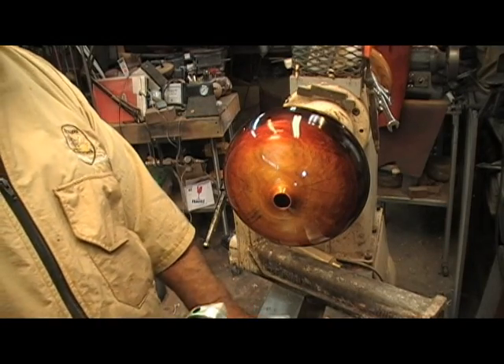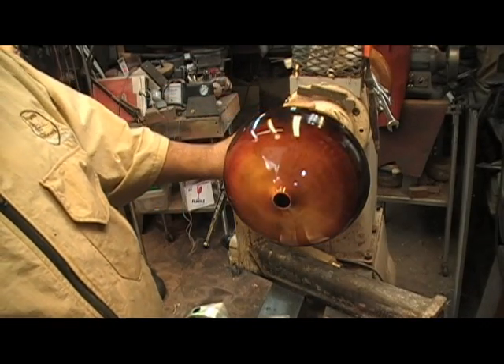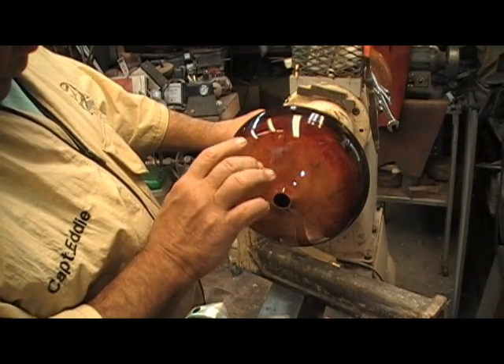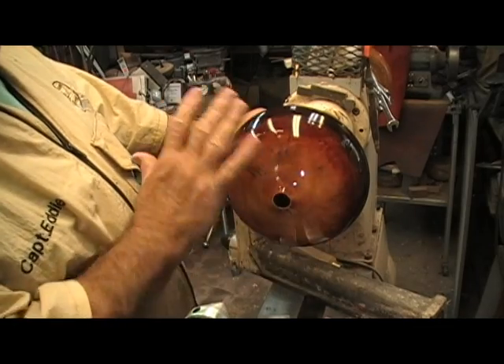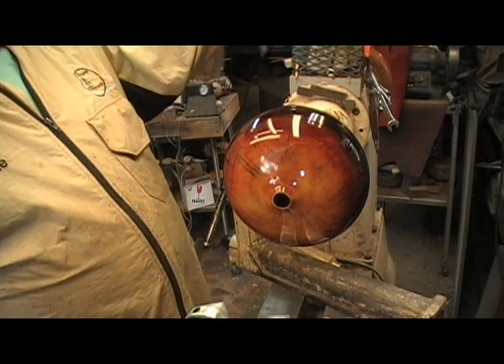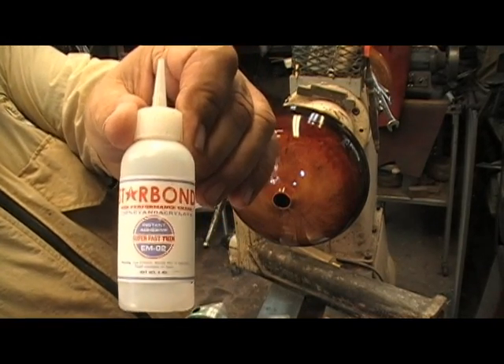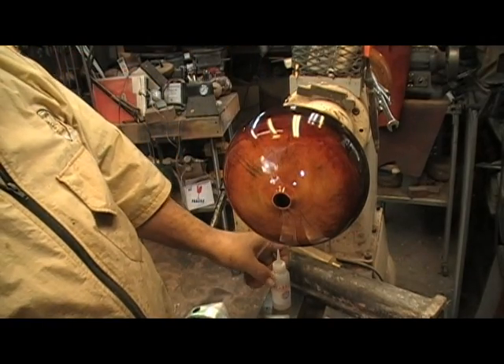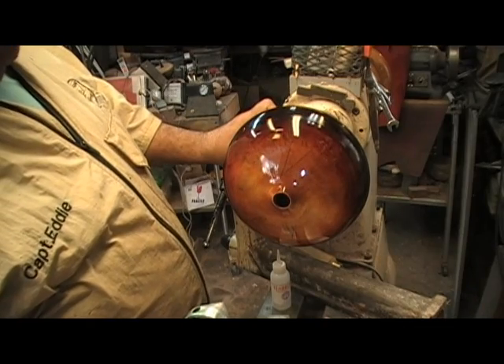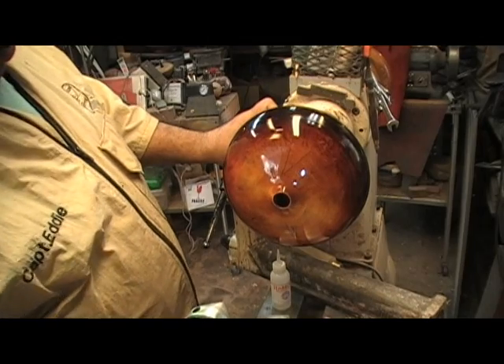As you can probably see, with one or two coats of sealer and then starting to build up the depth again over the top of it, I've got a pretty good finish on the piece. In order to take out some flat spots and brighten it up a little bit, I'm probably going to sand it with 800 to 1000 grit, look for those spots and touch them up with a little bit of CA - the Superfast Thin by Starbond. I saw a demonstration by Alan Trout last week on how to apply it in real fast moves, and I think I'm going to try that. But first this finish has to cure. I think I'm going to wait.